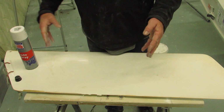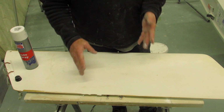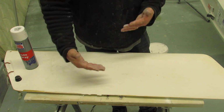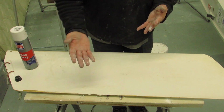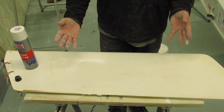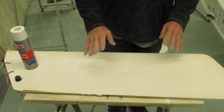So there you go. Those are all the stages we've done, but that will ensure that your centerboard won't fail again. It won't break off because it's now got the pins in holding the material to the body with glass fibre right across it. That's really super strong, but you're going to have to do that to succeed. But you can completely renovate your laser foils. It's probably about a 4-stage visit, as you can see, but it's worth doing.